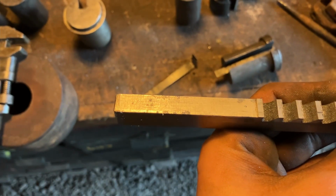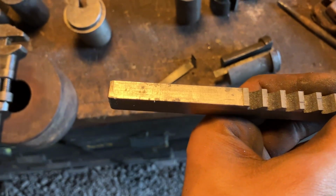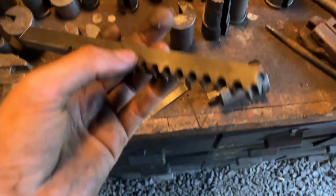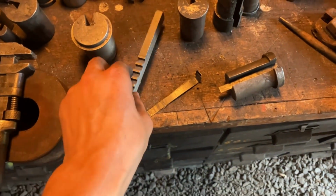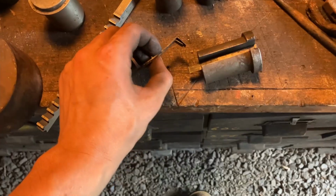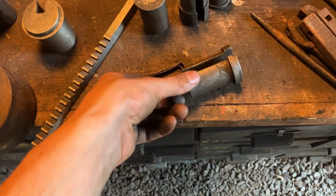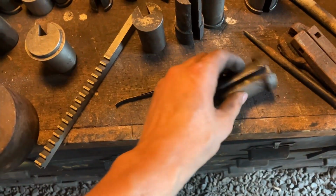There's the broach I used. You might be able to just see on the top 3/8 CCHS. It's broken, but it still does the job for, it's only about a 2.5 inch pulley. So these are some of the shims, 3 thin ones and a thicker one. So we did about 3/16.